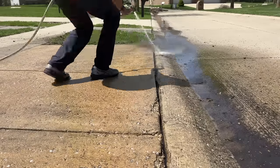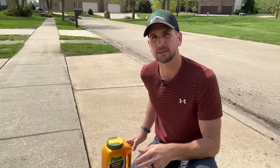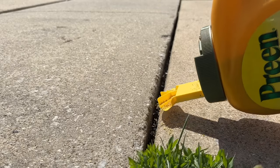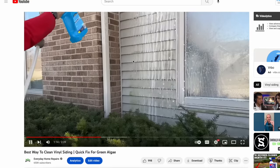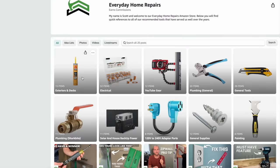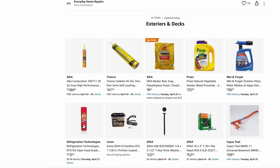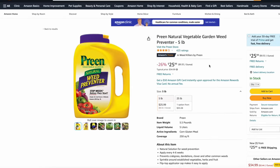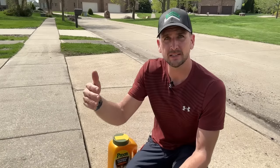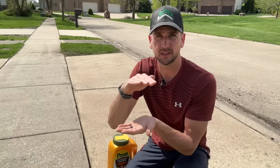After a little dry time, we'll be ready for the next step. Now things have dried out, and for that temporary solution — which should last you about six months — just sprinkle some Preen into the actual expansion joint. You can find a reference link below this video to our Amazon store; in the exterior section you'll see this product and the other products featured throughout this video. So just sprinkle it out, letting it sit in that crack, and really that is it. When it rains again, more dirt and debris will fill back in the expansion joint, but the Preen granules should stay in that soil, helping to prevent any weeds from growing by killing them at the root.